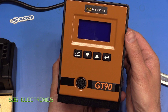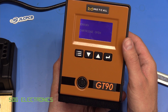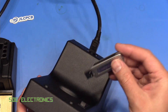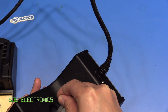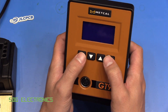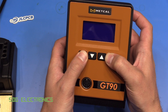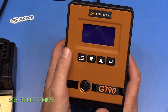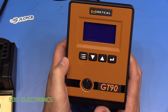At the moment we're running quite an old version of the firmware — this is version 83 and the one on the website is version 96. So I put it on an old USB stick and we plug that in, press the outer two buttons, and power it up. We count to three and then release, and after about 10 or 15 seconds it's supposed to boot up with the new version of the firmware.